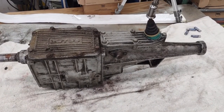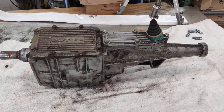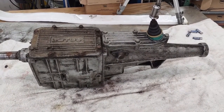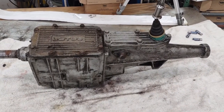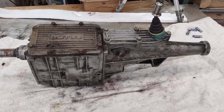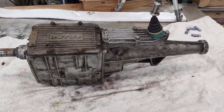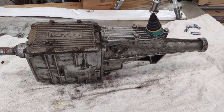I'm going to get the book out, start doing the pages — drain oil, take the covers off. You put it in third gear before you take the gear cover off. We have one bearing in there that is shot, in between the first and second motion shaft, causing vibration in every gear except fourth. So this is the start of this job.